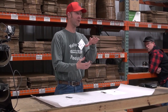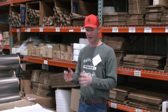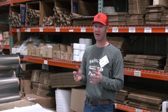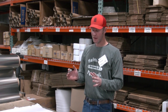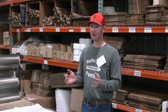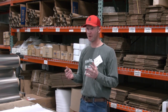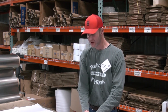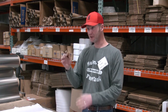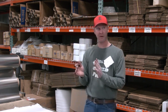And so I tilt my platen to 9 degrees. That's what I found for the length of my lock bars for my knives. 9 degrees is about the magic number for lock faces. Sometimes you're gonna have to adjust depending on lock bars. My lock bars, I try to keep around 2 1/4 inches for the most part. That's how I design them. If you start getting into shorter lock bars, under 2 inches, like 1 3/4 inches, you're probably gonna have to change your angle up to 10 to 11 degrees maybe. It just changes depending on how long the lock bar is.